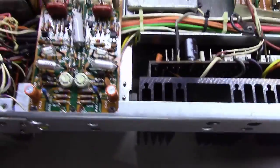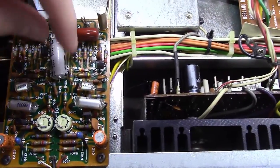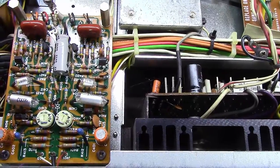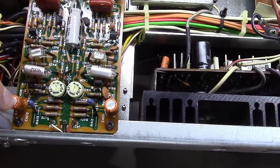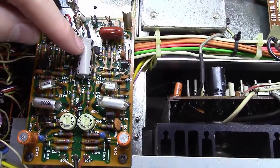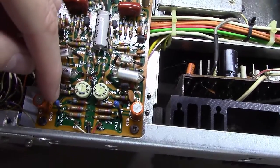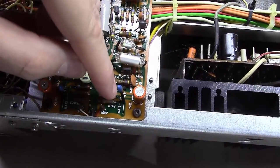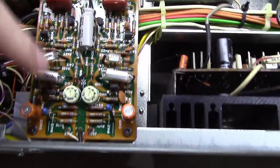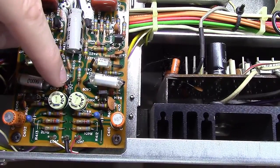A couple things to note. If you've seen the P700 video or not, they're kind of similar but a little bit different. A couple capacitors on here that need replacing — certainly these electrolytics here and this electrolytic here needs replacing. You've got these two tantalum caps here that need replacing and we're going to replace those with some electrolytics. These are 1 microfarad at 25 volts. We've got a teeny little diode right here that we typically like to replace — those things are notorious.